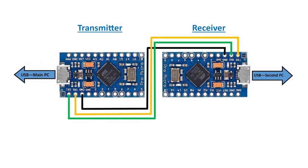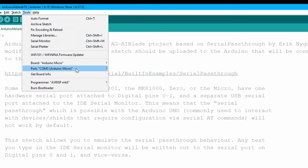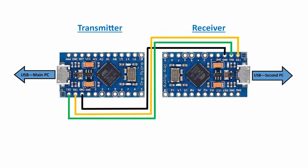Hardware setup is pretty simple. All you have to do is connect everything up according to this diagram, then upload the appropriate sketch to each Arduino. We'll call one Arduino board the transmitter and the other one the receiver. The transmitter will get the TX sketch and the receiver will get the RX sketch. These are very simple sketches to allow for maximum customizability — the transmitter just sends anything it receives to the receiver and the receiver presses that key. When you're getting your Arduino set up, take note of the COM port that the transmitter uses because you'll need it later. This diagram as well as the sketches and AutoHotkey script can be found at a GitHub link in the description.